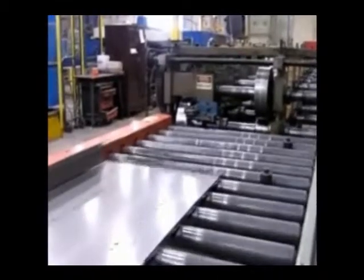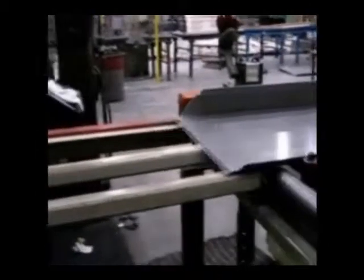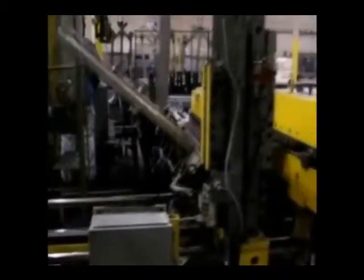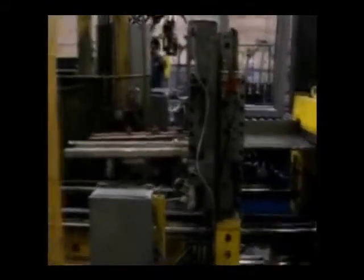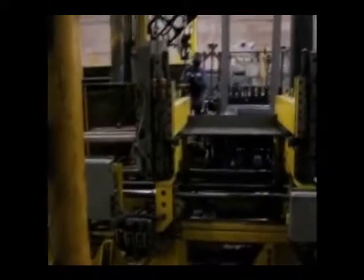The feed and form system is slowed down to produce a completed full wrapper cabinet every one and a half to two minutes. This is a just-in-time production system and all parts are welded and placed directly onto the assembly line. The ends and corners are welded offline and then the back panel of the cabinet is welded with a robotic welder. Production rate for the welding is approximately four to five minutes per safe.